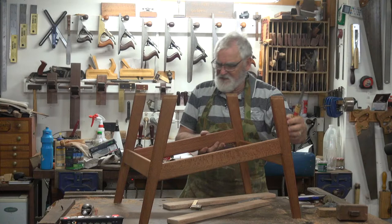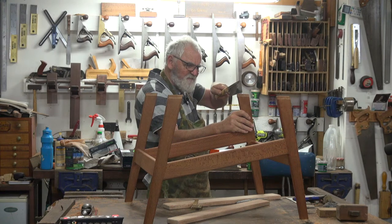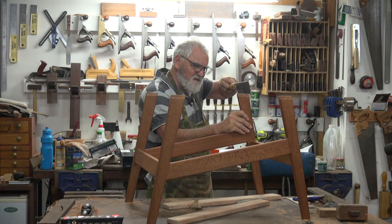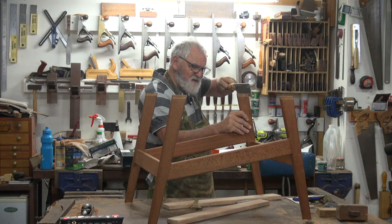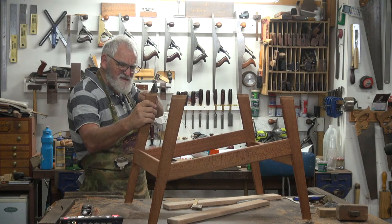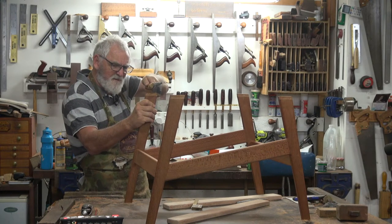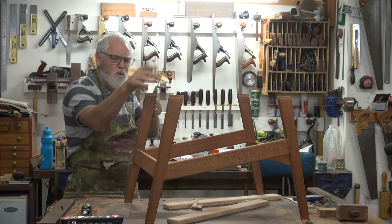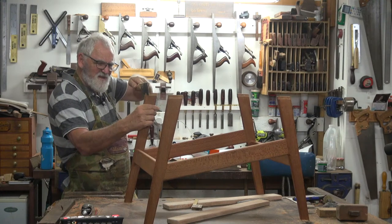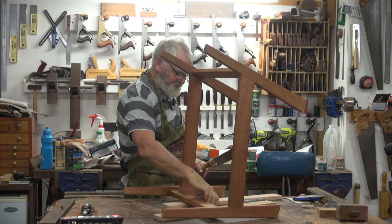The next oil I'm going to put on, which will be after I do this, is... I'm going to use steel wool. We cut into the grain of the timber and also knock off any furring up that's happened with the timber. There you go. Yeah, it'll be right. If I didn't tell anyone, no one would know.